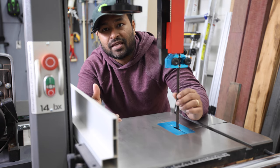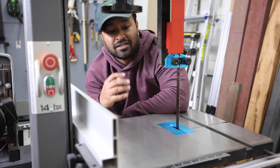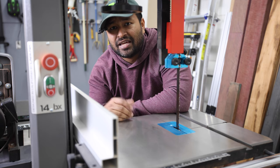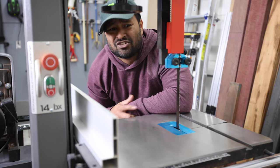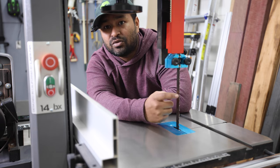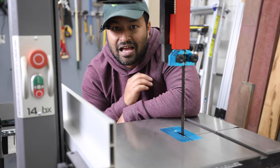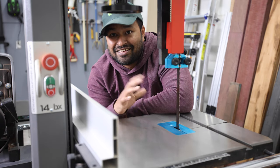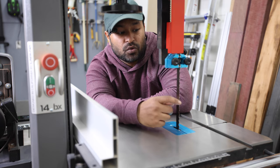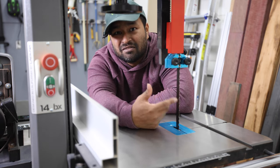As far as the blade goes, I am using the Resaw King by Laguna — a carbide tooth blade. Prior to this, I used Timberwolf blades, which were just high-speed steel. They work really well out of the box but get dulled pretty quickly and the changeover can be annoying, and the cost can add up. When I had the Timberwolf blades, I purchased the Laguna Resaw King kind of as a joke, thinking Laguna was full of themselves. And then I tested it head-to-head — this is better in every way. So if you have doubts about carbide tooth blades, chances are you're going to love it once you get one.